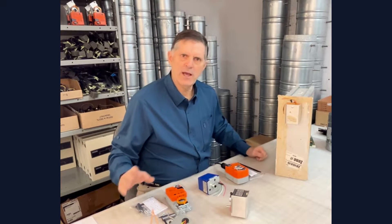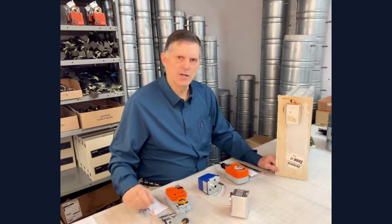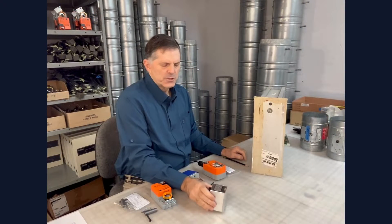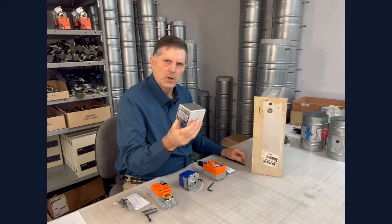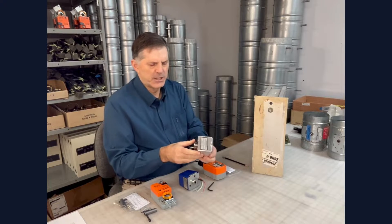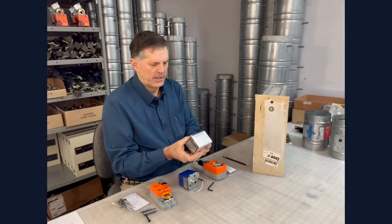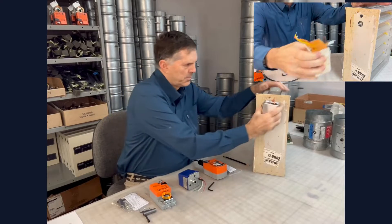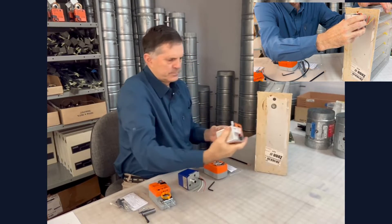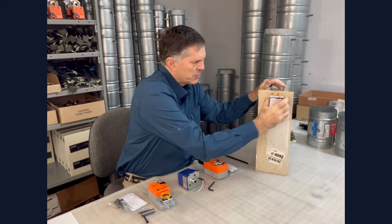This is not really our technical video — we have another video for that which talks more about installation and other parts and pieces. I just want you to understand your options if you're thinking about replacing one of these damper motors. The first and most popular is our RZ31 motor, available directly from our website, on Amazon and eBay. It's a big seller and unlike the Honeywell motor you're replacing, it has all metal gears — no plastic gears. It's as easy as pulling the old motor off, putting the new motor on, and tightening the set screw down below. In fact, most of them install the same way.